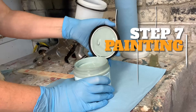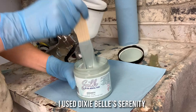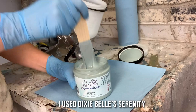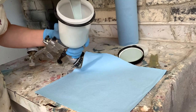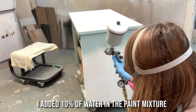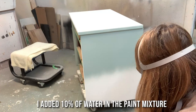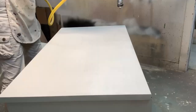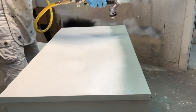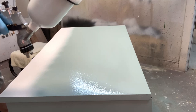Finally, some color! I ended up using Dixie Belle's Silk All-in-One Mineral Paint in the color Serenity. It's a gorgeous blue-green, yet a little muted, and I thought it would play off nicely with the very warm wood of the drawers — and it didn't steer me wrong. It's a beautiful color and I'm really pleased with it. I thinned it with 10% water before putting it into my Husky spray gun, which just makes it easier to spray. Silk All-in-One is an all-in-one with primer and top coat built in, though I had already added primer separately for extra protection.